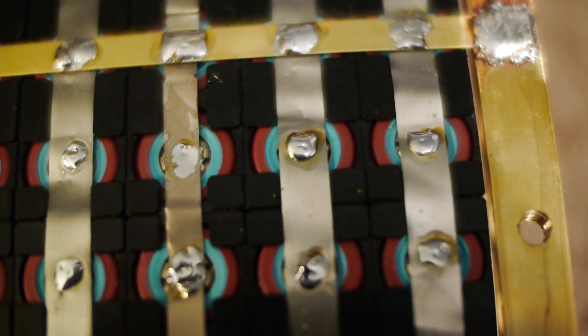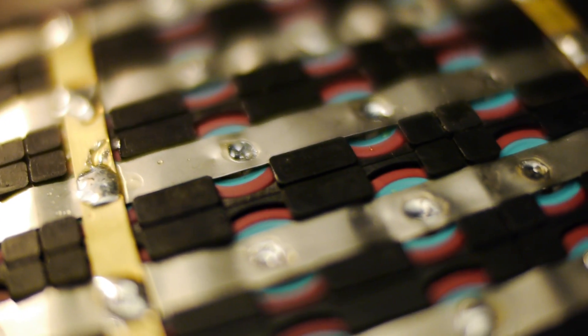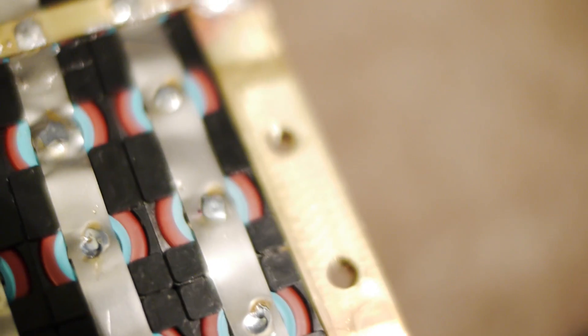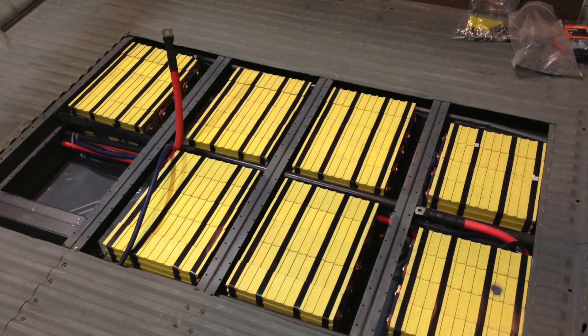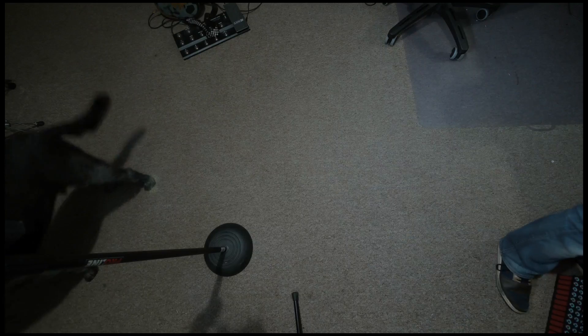On the finished module, I finished soldering both the anode and the cathode side. I purchased half-inch wide, 3/16-inch thick strips of copper to serve as the main module bus bars between adjacent modules. It was a pain to solder such a large piece of copper at first, but once I broke out the torch it was a piece of cake. I will use four smaller cables to interconnect modules instead of one large one like the current prismatic setup. For that, I drilled and tapped quarter-20 threads right on the bus bar.